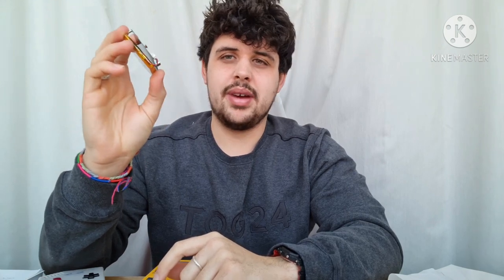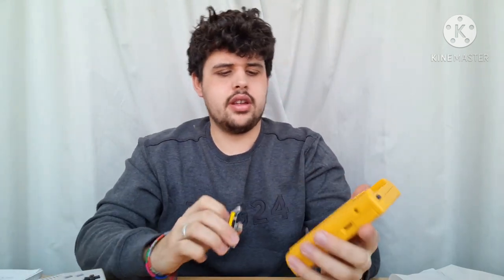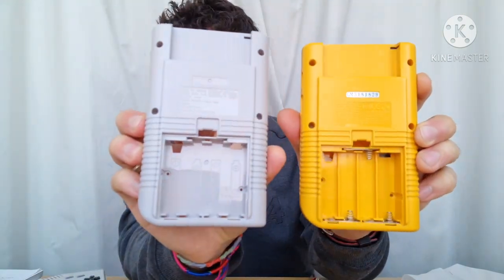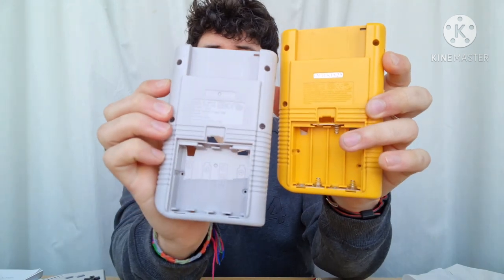I think it's something like 10 hours battery life — I've not tested it yet, so that is one thing I do need to do. It's just a little rechargeable battery and it fits into the Gameboy. If you've got an original Gameboy, you will need to mod it slightly — there are differences between the original and the Retro 6 one, as the original has ridges inside which need to be cut away to fit it in. This one is all smoothed out and ready.